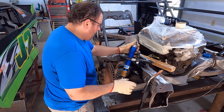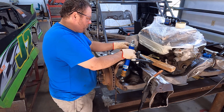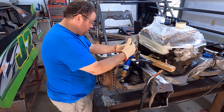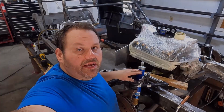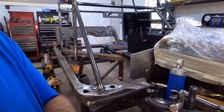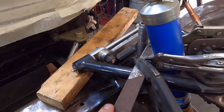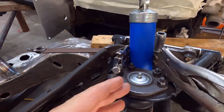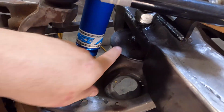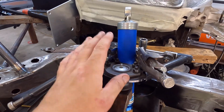So now at this point, I really need to depend on the shock to hold everything solid. So what I'm fixing to do is take some pieces of metal and some vice grips and clamp this shock up, to make it immobile where it won't move. I've put in some vice grips here to hold the shock in the right location. So let me show you, starting out where I think might be the right location. I just clamped the bar across the back and clamped some vice grips on. Now I've got this guide. What I'm doing is trying to make clearance here, in alignment, still at 90 degrees there. Okay, so that's what's going on here.